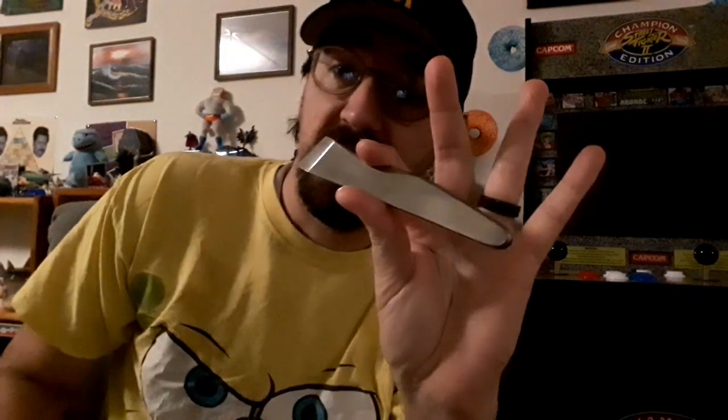I will say, I'm probably going to wind up making myself another one in this design, just because I like this design. But that's neither here nor there. We are going to go in the war room and start with, I want to say, a 220 grit belt, and work on taking tiny, tiny bites out of this to get it pulled back to where I want it. Once we get this corner right, we'll work our way up the grits and get this nice and clean and shiny again. I may go with an 800 grit satin finish on here just for ease of operations more than anything else. We'll see. But let's go to the shop. Let's see what we can do with this, and with the sheath.